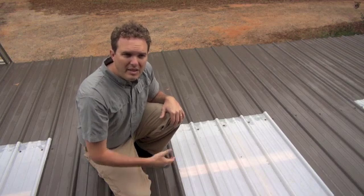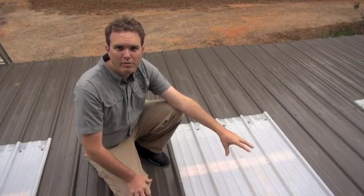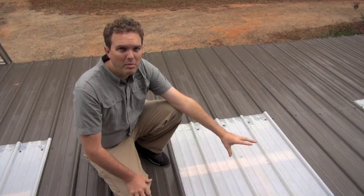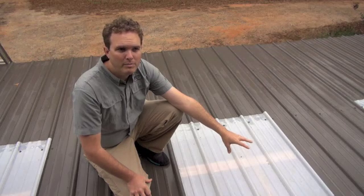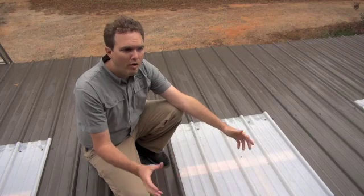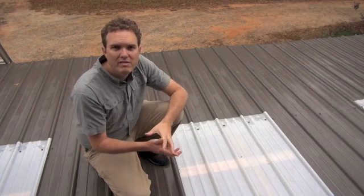And that's the basics on how to install this — it goes down pretty much just like any other piece of metal roofing with those couple little contingencies in mind. One thing to warn you about: these panels are real durable and will support a lot of weight, but when you're working on them — especially on a metal roof that has old panels — be real careful not to step on them. Old panels are frequently made of fiberglass and can be real brittle. It's a big safety hazard, so we usually rope them off or put cages over top of them to prevent anyone from accidentally stepping on them and falling through. Thanks for watching this installment of the Roofing Intelligence series on how to install metal roofing.